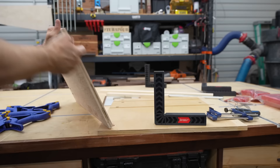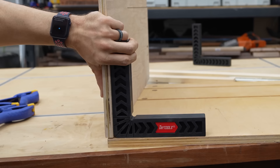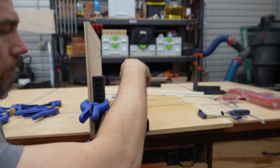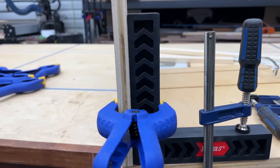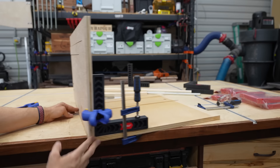They're a perfect 90-degree angle regardless of size. If you were joining two pieces together, you clamp the square in place and it holds at a perfect 90. You can also use F-style clamps in similar situations. Once it's at a perfect 90 with pocket holes drilled on the back, you can attach the pieces when you need to — and if you want to take a lunch break, it's going to stay there and not move.